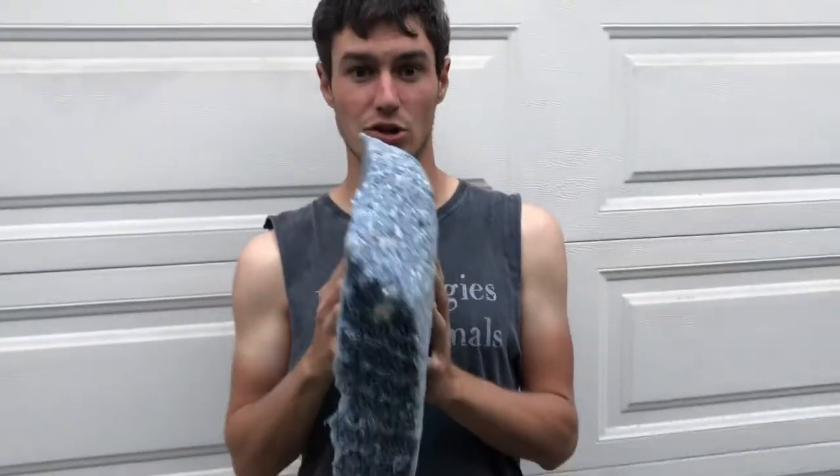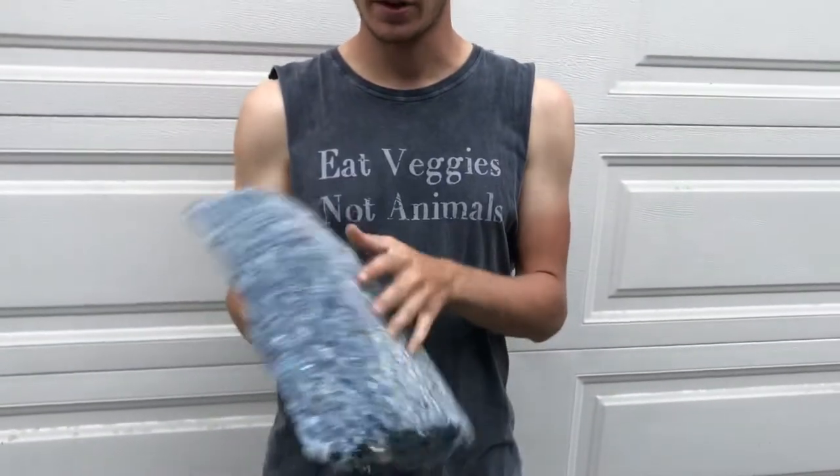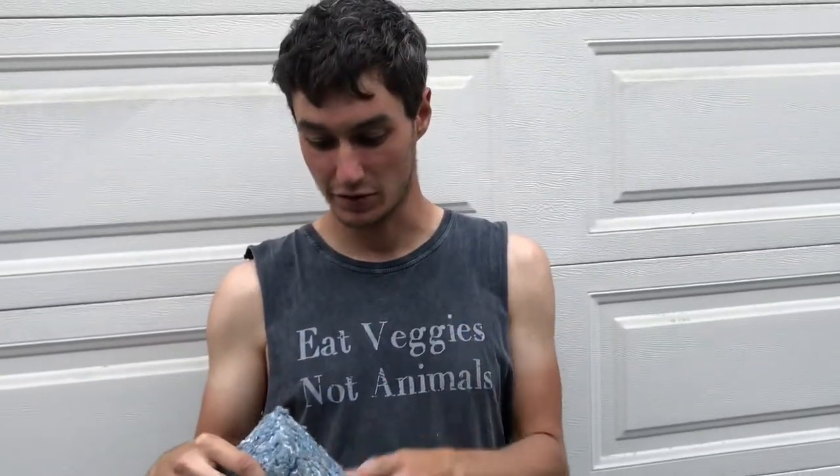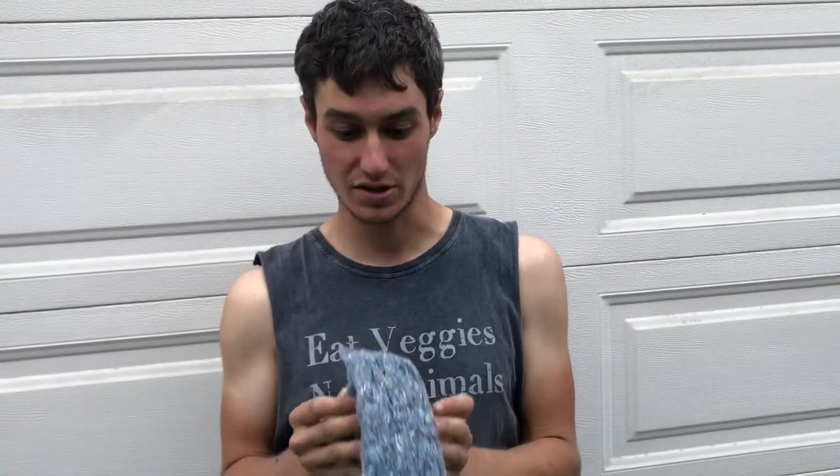We're doing insulation - we're using the denim right here. Before you put it in, denim insulation when it is shipped gets compacted, so before you use it you're supposed to open it up and shake it out - that'll help start getting it expanded again to its natural position. We didn't actually open ours up first, so we're going to pack it so it's not really tight in there, knowing that it's going to expand a little bit.